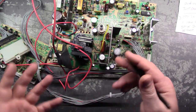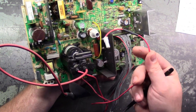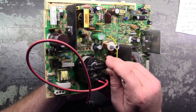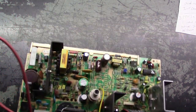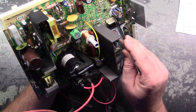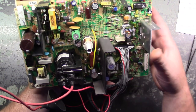The caps all look original, except for a couple here. Our G2 wire is not hooked up to the neckboard - it probably came off in handling. See how the glue is missing off of this cap? And this cap too. But on this cap the glue is still on it, and the glue is still on the bipolar cap. So some caps have been changed and some haven't. I don't know what the idea behind strategically replacing caps is - I would have just done all of them.